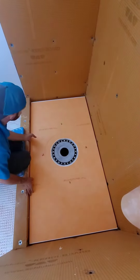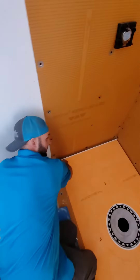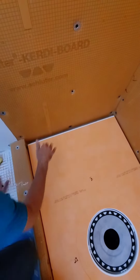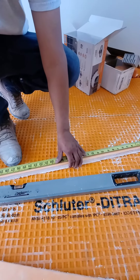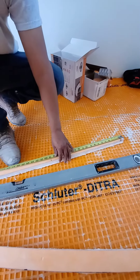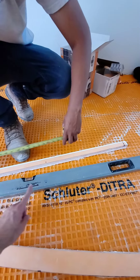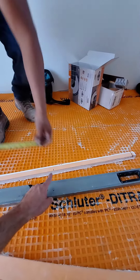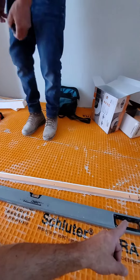Now what I want to show you is the gap — see how there's a little gap over here? We've got some scrap pieces of foam, so we're going to cut a little piece and throw that in. One thing that's important: you want to center it first and then make your measurement of the halfway point. We had 32 and a half, so that's 16 and a quarter each way — we'll cut off a little piece off each end.